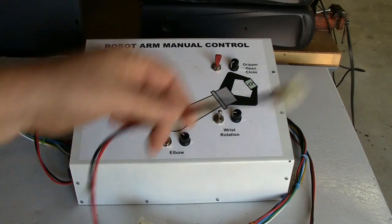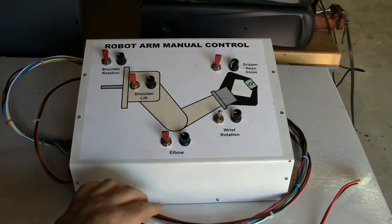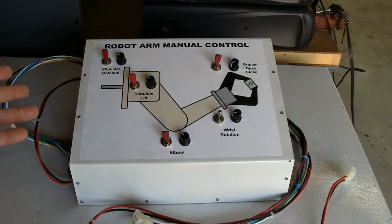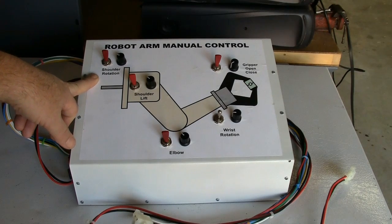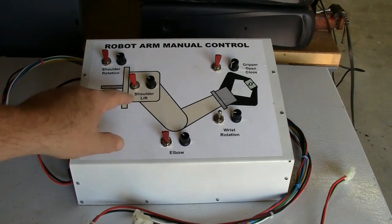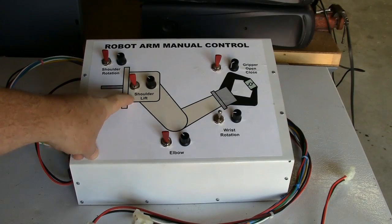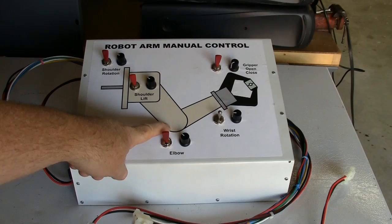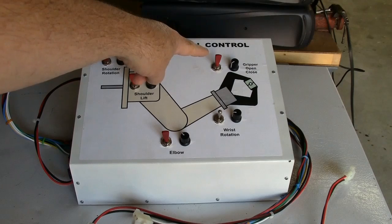Here's the power connector and the arm connectors. Each one of the degrees of freedom is controlled for one arm: what I call shoulder rotation, which I should demonstrate with the faceplate off on the robot; shoulder lift, which is the biggest cable drum mechanism; the elbow joint, which is the second cable drum mechanism; wrist rotation; followed by gripper open and close.